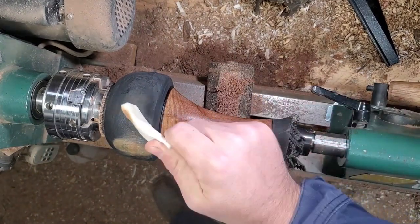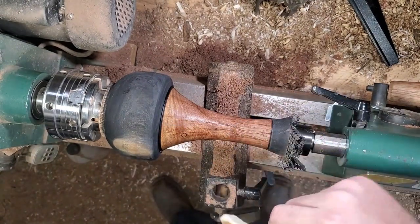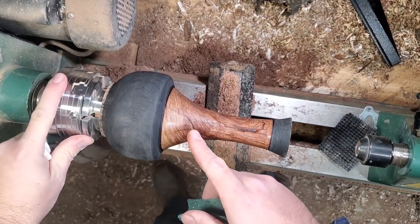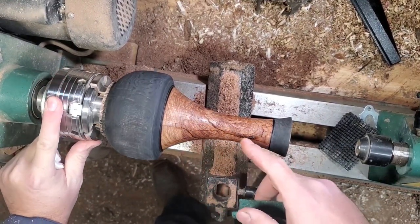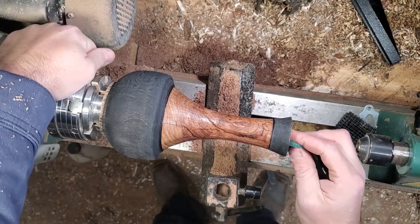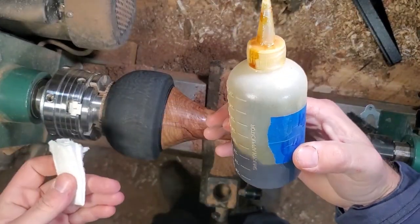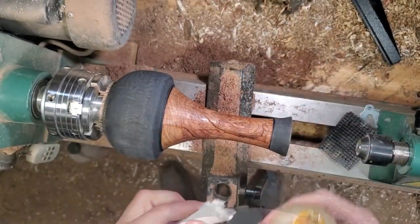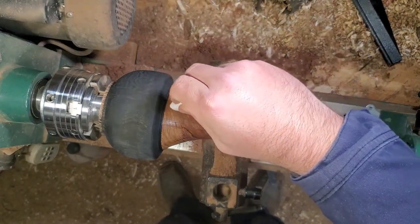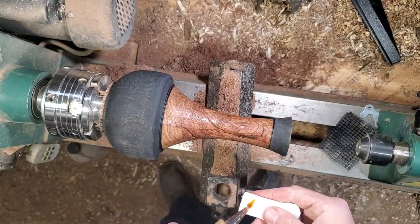Then I'm going to use a garnet colored shellac on the black portion. I got three coats on here — two coats, then I used a brush to get inside the cracks, then spread it out again. This is a one-pound cut — all the shellac I make is a one-pound cut. This garnet is going on only on the black; I did the blonde first in case the black bleeds over. Hopefully the shellac creates a barrier so it doesn't seep in — we'll see.